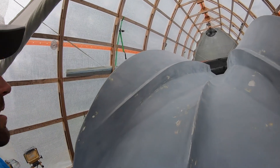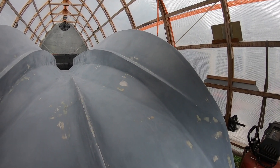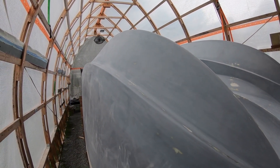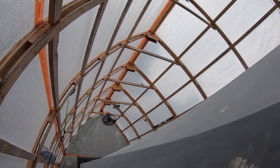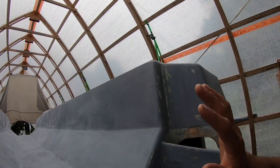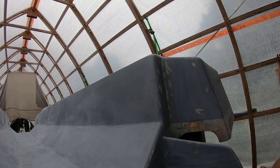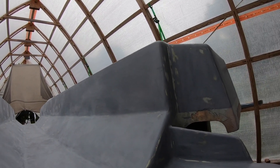Sanding is done. We're going to start prepping for paint tonight. All we're going to do is wipe everything down with acetone first, really concentrating on the bottom of the hull. We intend to do one more coat of the Total Protect barrier coat, let that tack up to a thumb print consistency, and then do a coat of the C-Speed out of Texas, which is a siloxane paint.